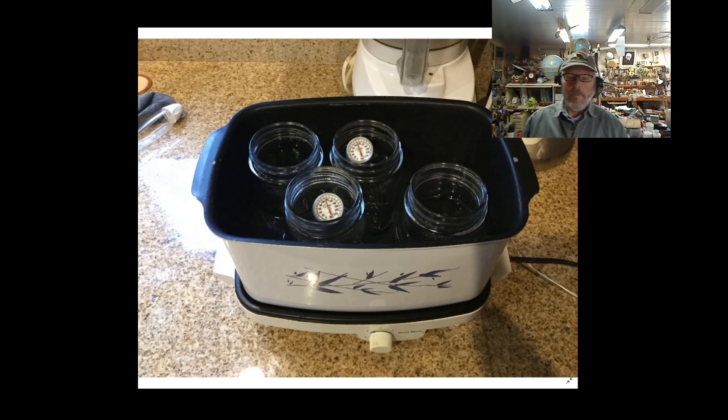One more thing: I was fortunate to have this West Bend slow cooker, built like a tank — I got it at an auction decades ago and it still works fantastically. I've seen them on eBay for about twenty dollars and even in Goodwill shops. However, a lot of round slow cookers have insulation built into the housing, which would not be appropriate here — you couldn't mount the sensor on the outside. And if you need to put the sensor into the water bath, a waterproof DS18B20 rated for outdoor rain is not the same as soaking it in 100°F+ water for eight hours at a time.